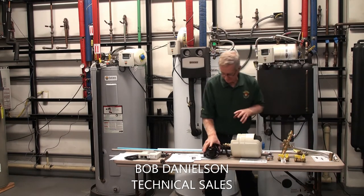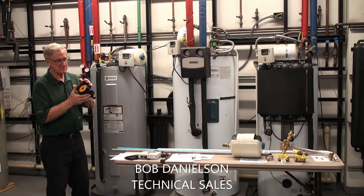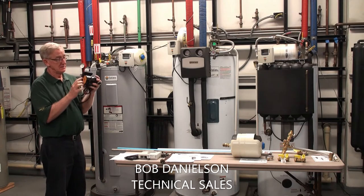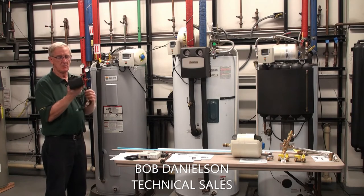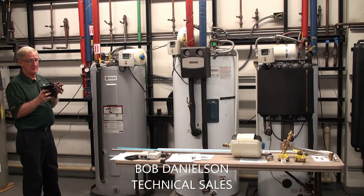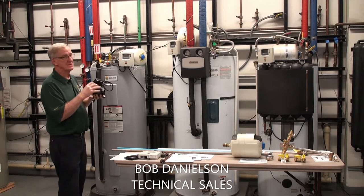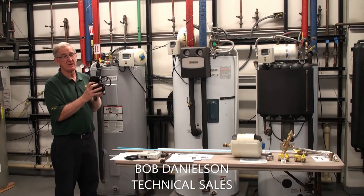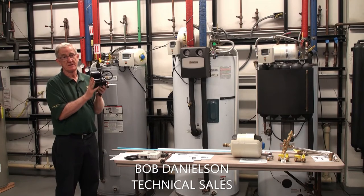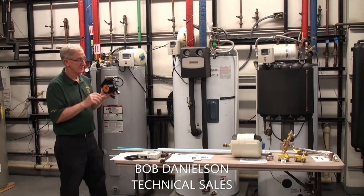The other item as far as the water system is the pump. We use a Grundfos pump. It uses about 35 watts. It's all stainless, all pre-wired, pre-tested — we test it here too. It uses about two-thirds the power that most common pumps used with these direct systems use. So it's very reliable, maintenance-free, and very energy efficient. With regular maintenance, you can expect 10-plus years from the pump.